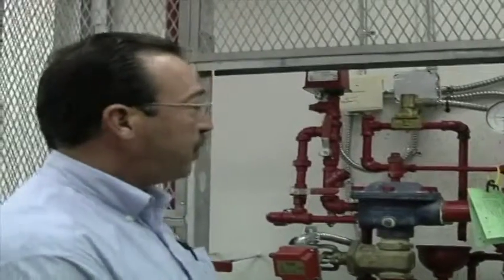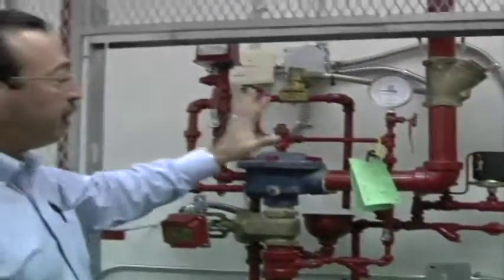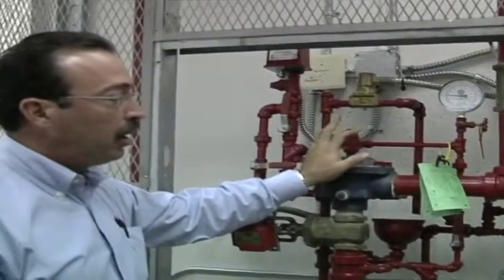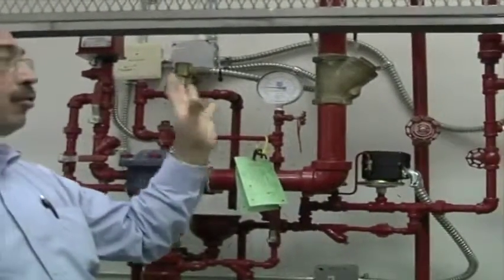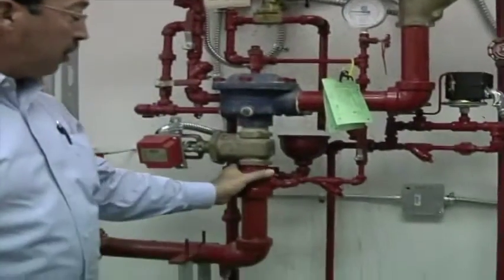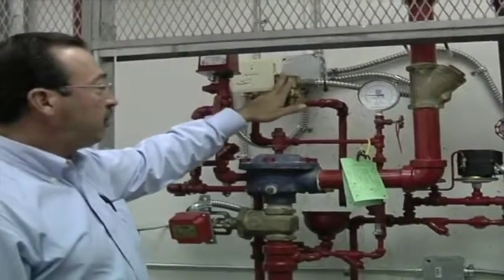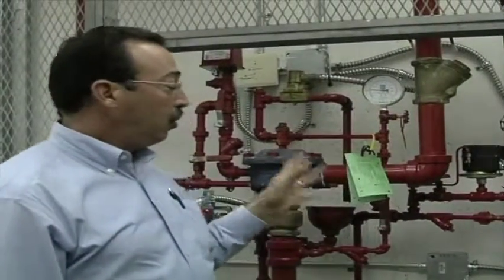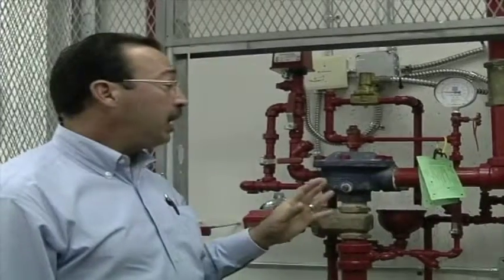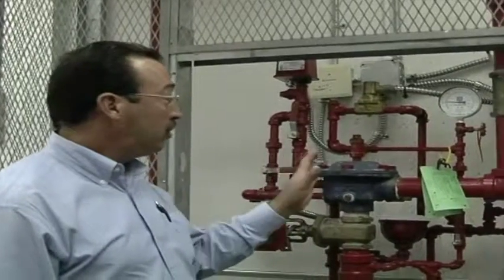Okay, now what we're going to have here is a brief explanation of the dry pipe system. The dry pipe system is not separate zones, okay, for the third floor. It is one zone. So all the sprinkler protection in the data center, in the NOC, the electrical room, and the print room is coming back to here. So everything in those computer rooms is dry pipe. The wet water is right here underneath the clapper. When the fire suppression system goes off, it's going to energize a solenoid, and what that's going to do, it's going to blow out the top pressure of the clapper, allowing the water to fill the pipes. There will be no water in the computer room, only in the pipes waiting at the sprinkler heads in case the clean agent system does not put out the fire. Okay? And this is your pre-action system.